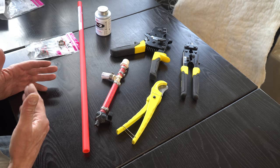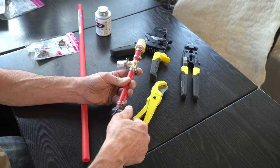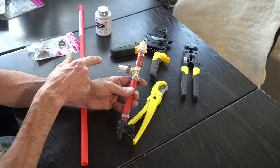This is the drain that I've removed from our tank. This would insert into the broken fitting in the tank, and then of course the water would drain out, and there was this valve here to be able to empty the water from our tank. This T in the center here is where we would pressure fill our tank, the water would come in this way, this valve would be closed, so the water would be directed upward into the tank. It's also the way that our water pump draws water out of our tank when we're boondocking. I'm really not thrilled with this design.